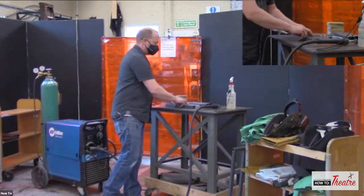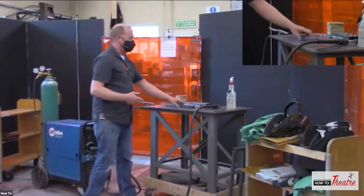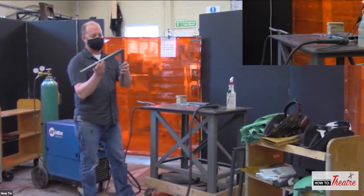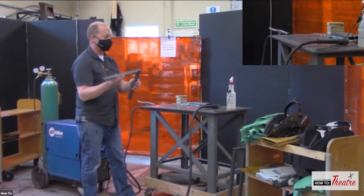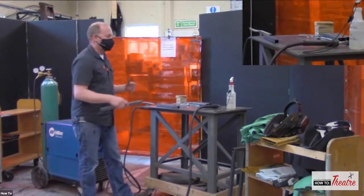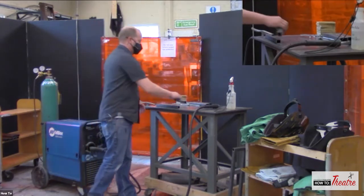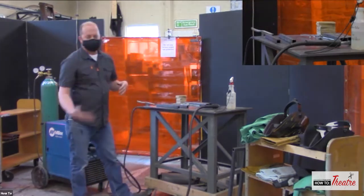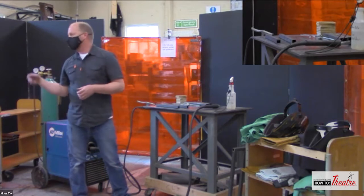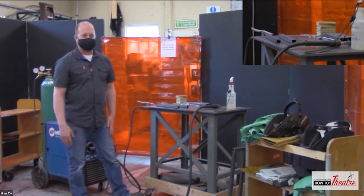So welding, once you weld it together, it's not like wood. You can't tweak it and stuff. Once it's welded, if you're crooked, then it's going to stay crooked. So having a nice square table and doing a nice layout on the floor with jig blocks to make sure that everything is where it's supposed to be is very important. There's a lot of setup in welding as far as cutting it, cleaning it, grinding it, getting it ready, laying it out, and then finally tacking it together.